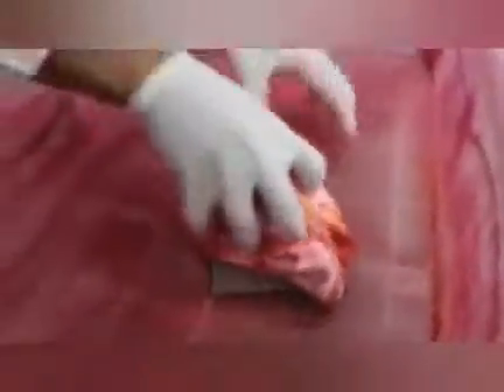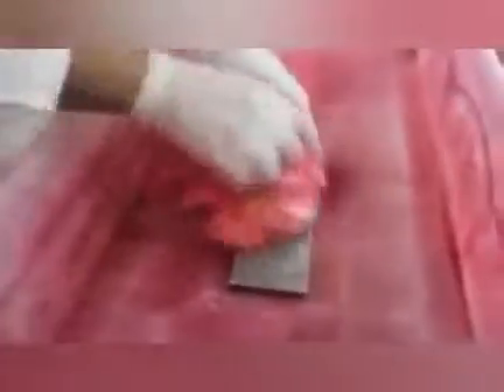The procedure is: pre-cleaning, application of penetrant and dwell time, removal of excess penetrant by water washing, drying, application of developer, and inspection.